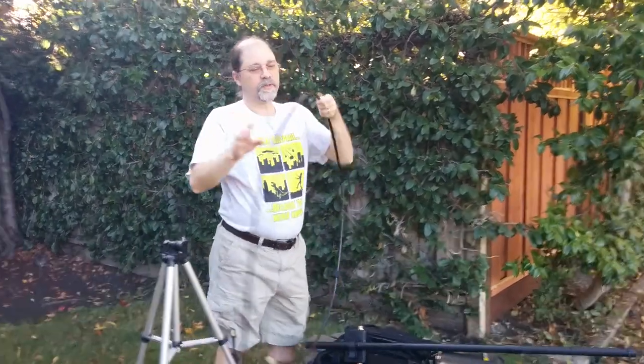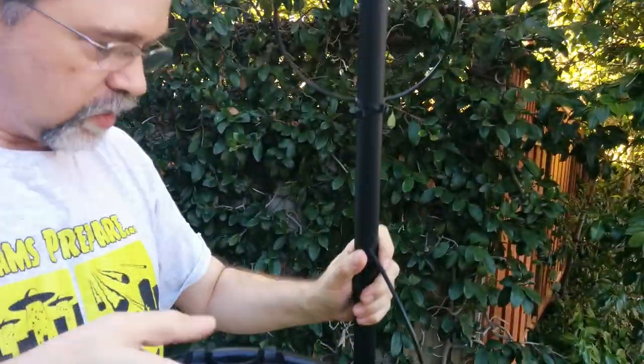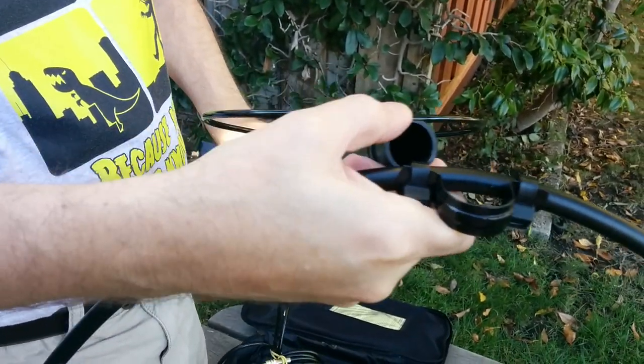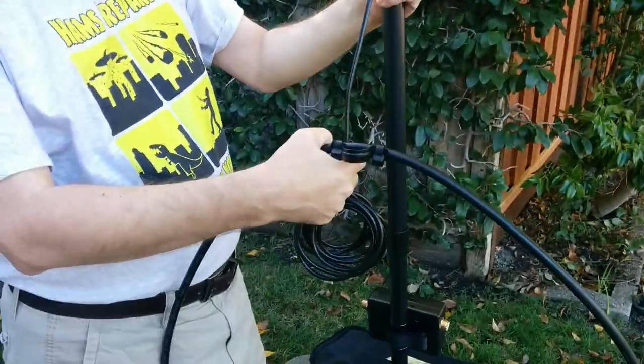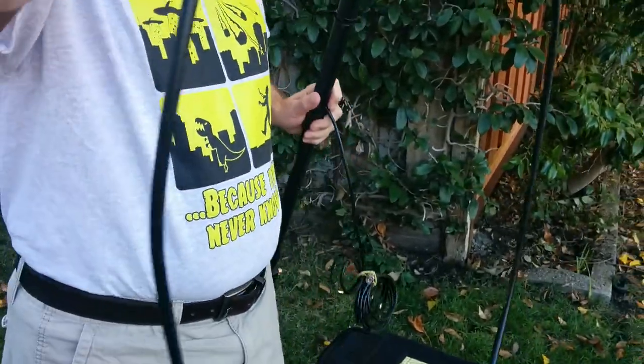This part here, you can see, is where the C-clamp is where it attaches. If you look on the top here, you will see that there is a shaved off part. The shaved off part is where you want to have the coax aligned. So you can see the coax comes out the back here, not the front. So you put the coax on second.